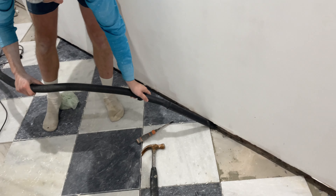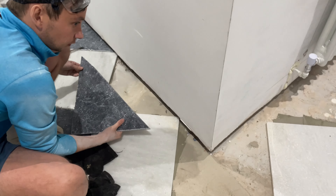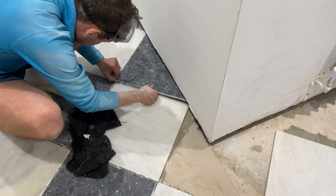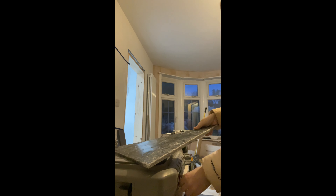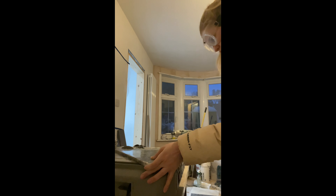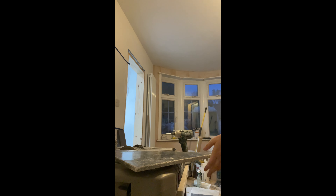Make sure that every time you are planning on putting a tile down, the floor is completely free of any dirt or dust so that the tile is able to go in and lay flat. At one point we could see a tile was already not straight — it's not good, it's not straight, you can see it.